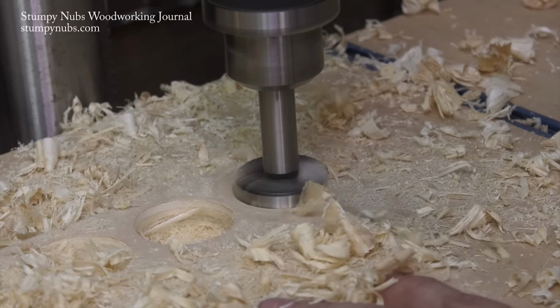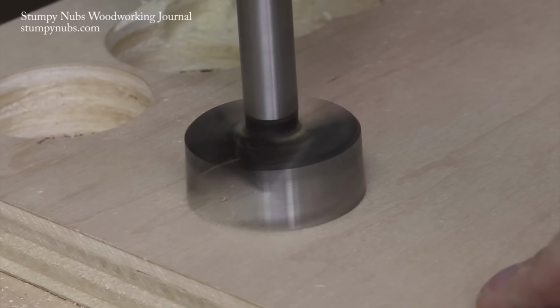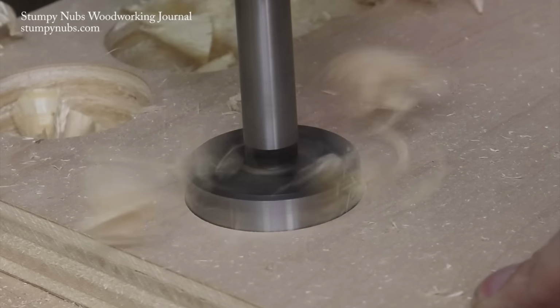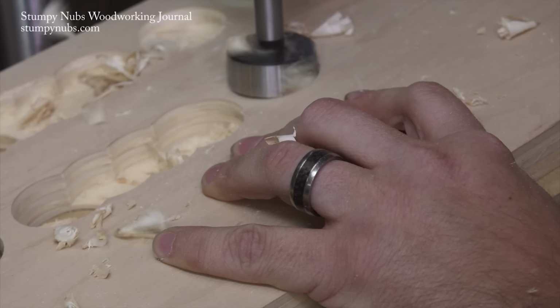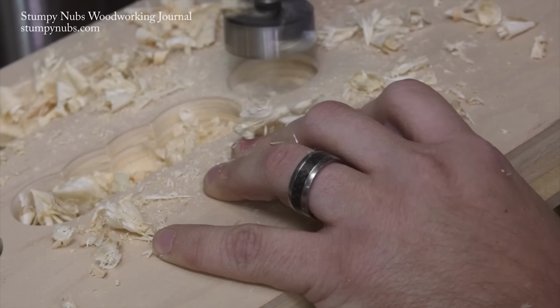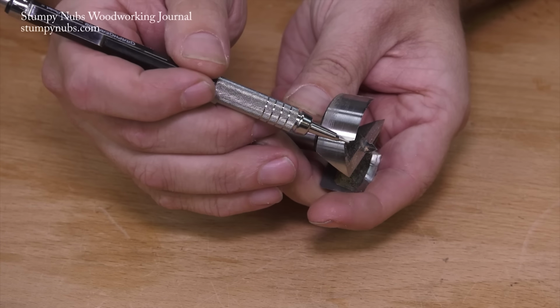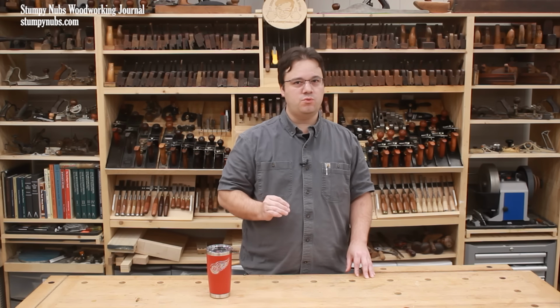Sawtooth also make it more difficult to work at an angle, and they produce a rougher cut when boring overlapping holes. Continuous rim bits solve many of those problems. They sever the surface fibers and enter the cut more cleanly, and they perform well for angled boring and for overlapping holes. But that continuous rim does generate more heat, especially on larger sized bits.